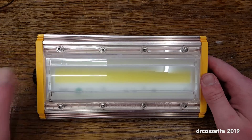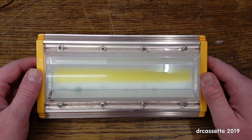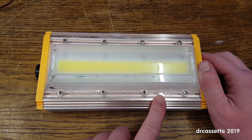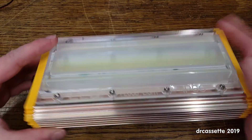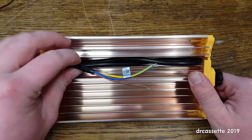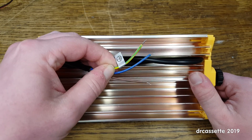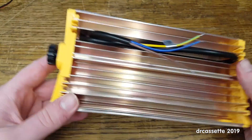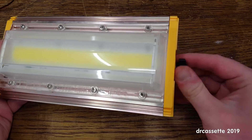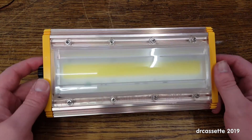Taking a look at this light, we have a long rectangular COB LED — chip on board — with a plastic cover over it. It says LED floodlight IP66, so it is supposedly waterproof and dust proof. The back is all heatsink, some extruded aluminum. Here is the power input — these connect straight to the mains, and a nice surprise: they do have a safety ground connection. The sides are plastic, with screw knobs on either side to mount the LEDs. With the 100 and 150 watt versions you do get brackets to mount the lights together.